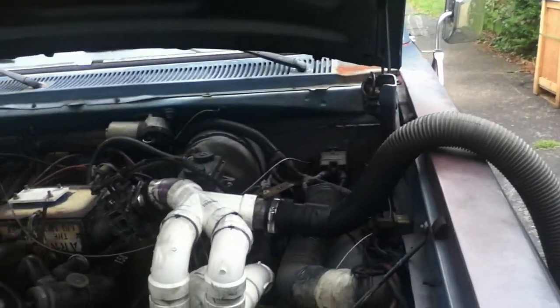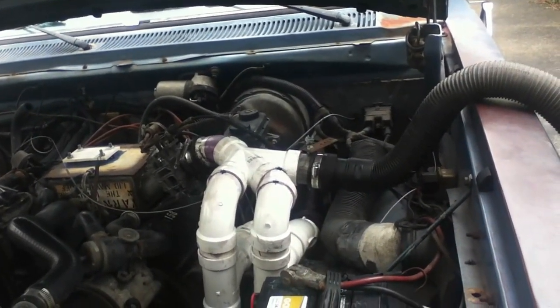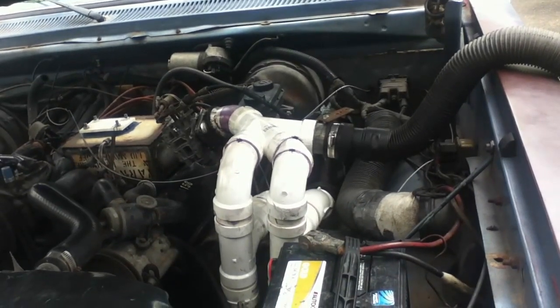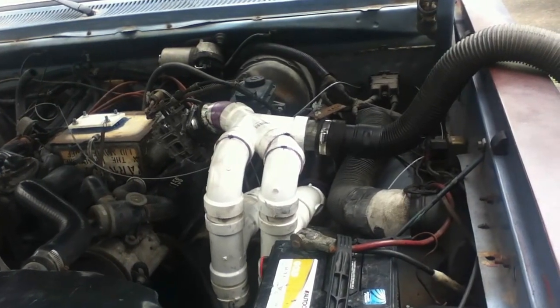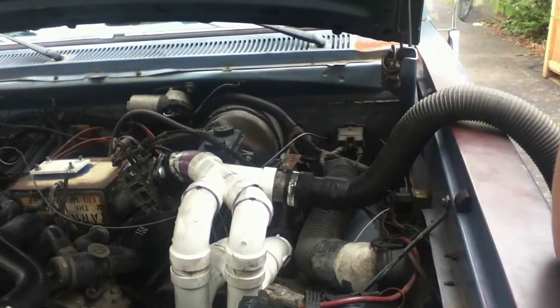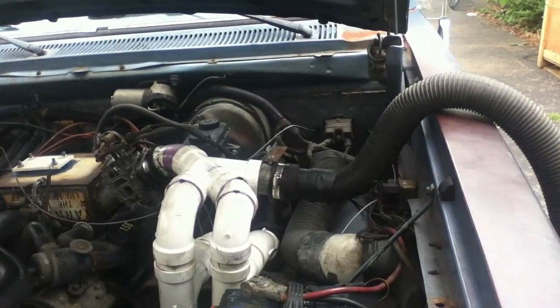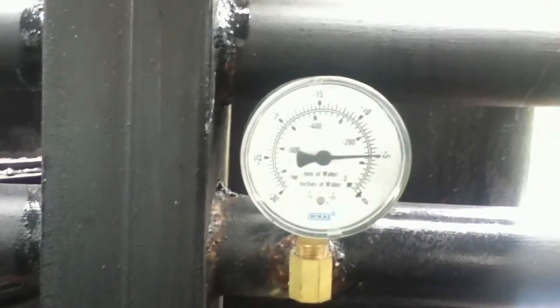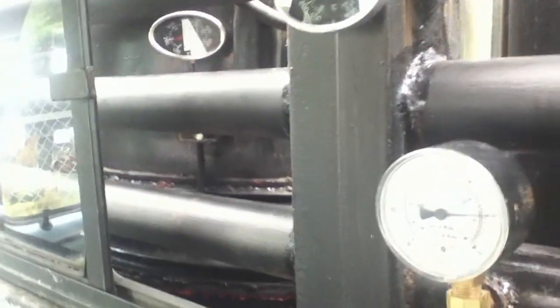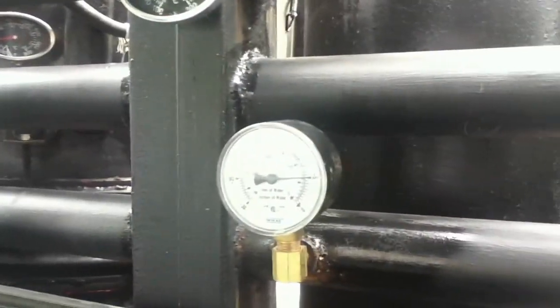That's wood gas. I'll just give it a minute to heat up to temperature. The shop vac is pulling about as much as the engine going down the road at maybe 10 or 20 miles an hour, so it's pulling a lot more than a standard blower would. Make sure this valve is all the way open — more wood gas closer there. Peeking in at the gauges: about 5 inches of water vacuum, about 300 degrees, and about an inch on the hopper. 200 degrees on the hopper, but that's just because we're sitting still. It may be getting low on wood.